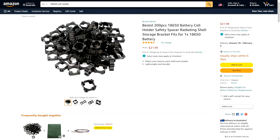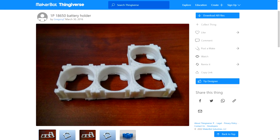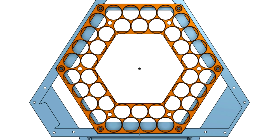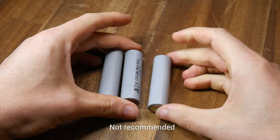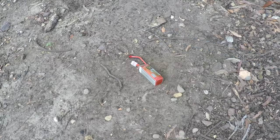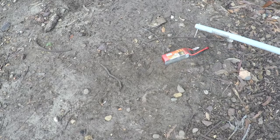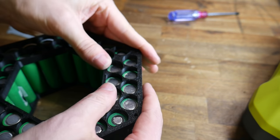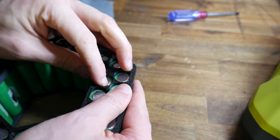We're now up to actually building the battery. If you search online, you'll find cheap clipped-together modular cell holders to build up a frame. If you have a 3D printer, you'll find many free designs on Thingiverse and other sites. I decided to design and print a custom frame, ensuring a small gap between each cell. Some people prefer to butt cells up against each other and use hot glue to hold them in place, but personally I think that's too risky. On the rare chance that cells are damaged on the outside, we know what's going to happen. A small air gap around each cell should also assist in keeping them cool.